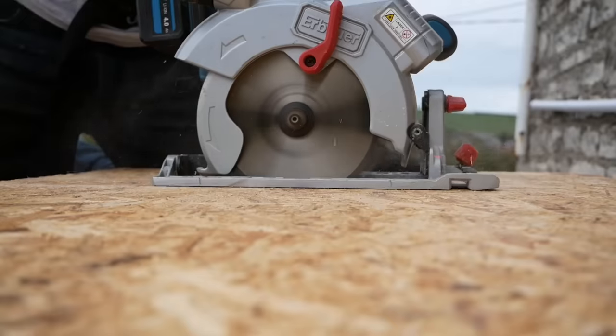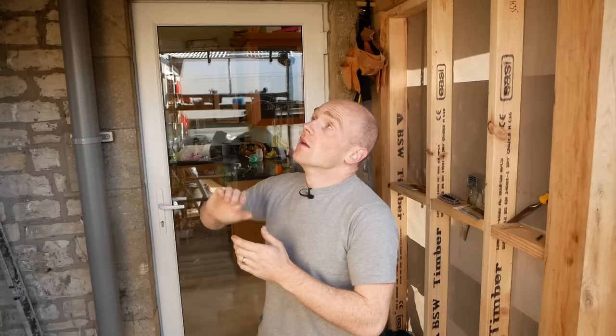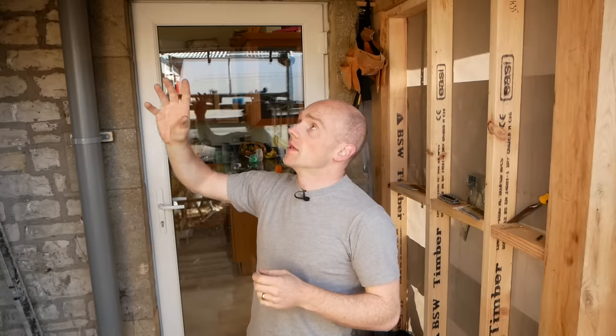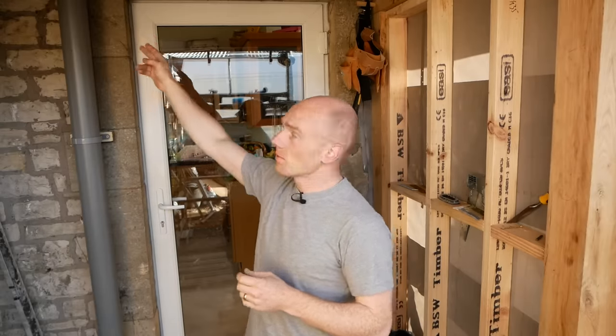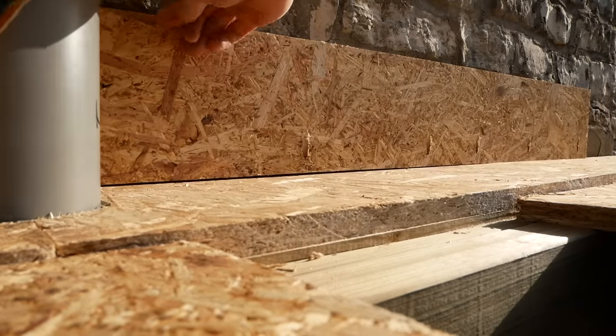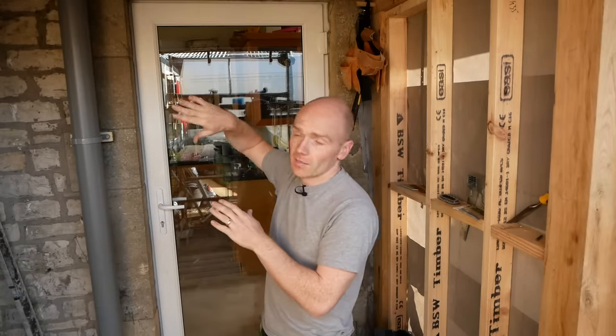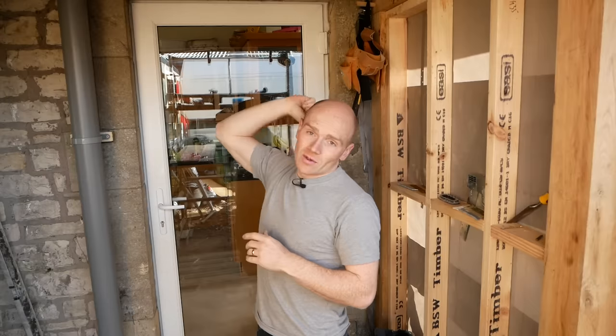So yesterday I decked out the whole top in OSB, that's the OSB 3 tongue and groove stuff that we used on the main roof, and I bought enough to do this one. So that's all where it should be. We've now installed that upstand along the stone wall, that just kind of evens things out, so it's much easier to dress the lead over afterwards and to take the EPDM up the upstand. So now we've got to deal with the roof light.